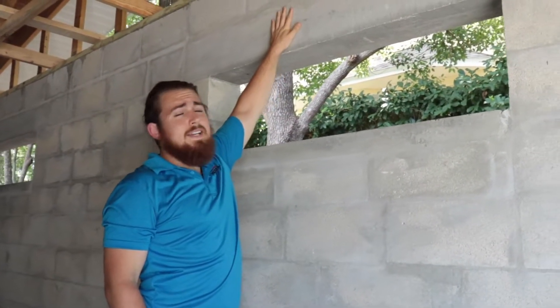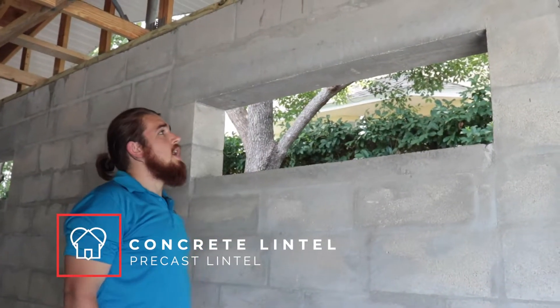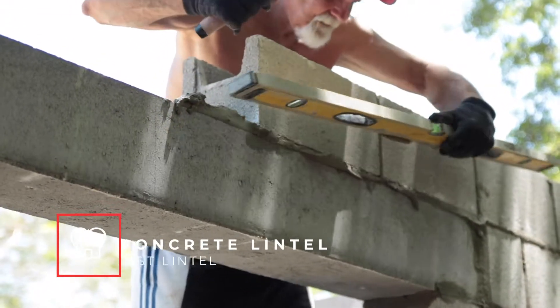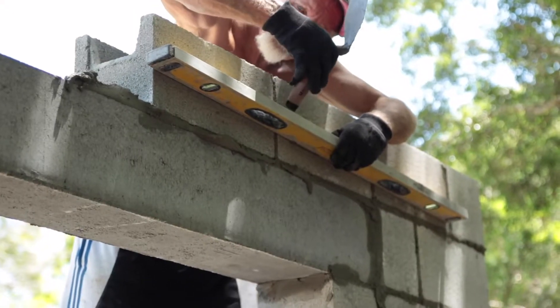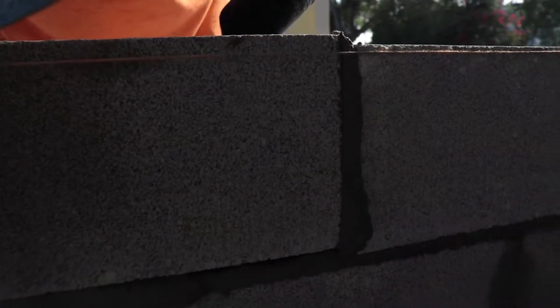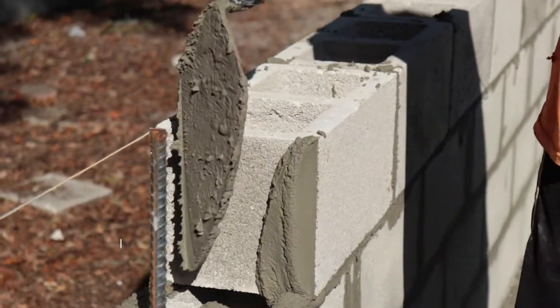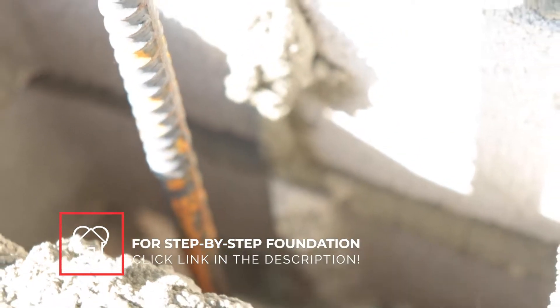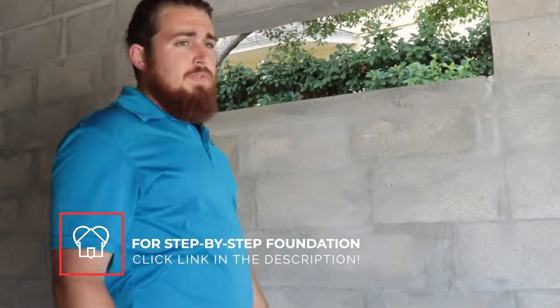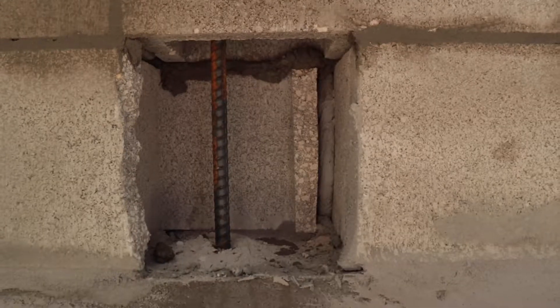This is what's called a concrete lintel or a precast lintel. It's essentially a U-shaped, really long piece of concrete block that gets set in place and then completely filled with mortar. What that does is it bears the load of these blocks in the middle and whatever weight is coming down from the roof, and transfers it. If you remember our foundations video, these cells are where rebar stubbed up — these blocks also got poured all the way down, so this whole row of blocks on either side of the window is basically like pillars in the structure.